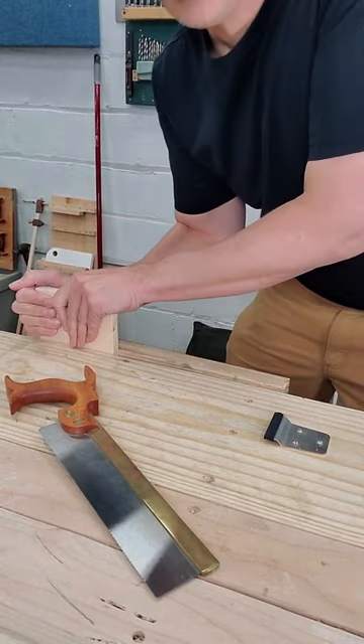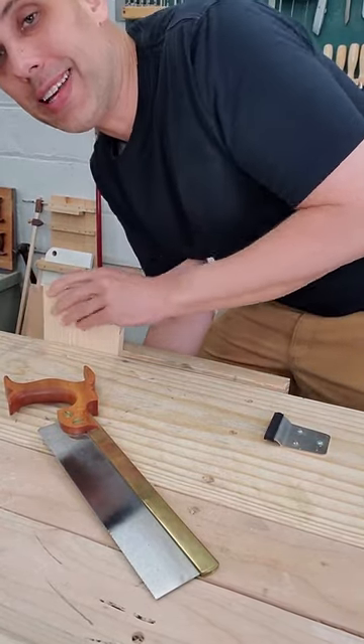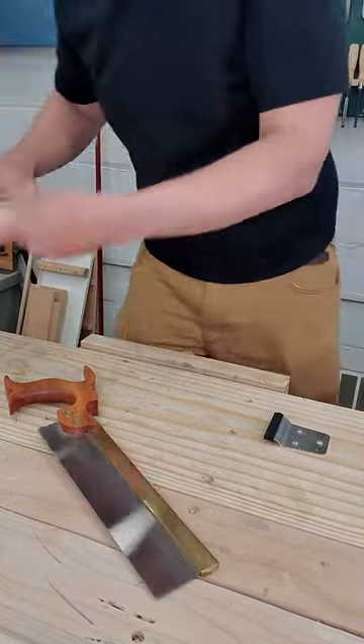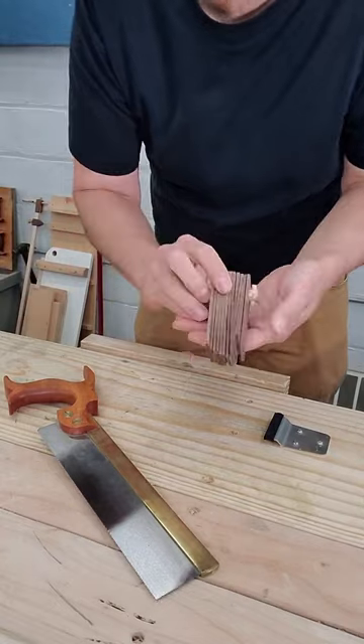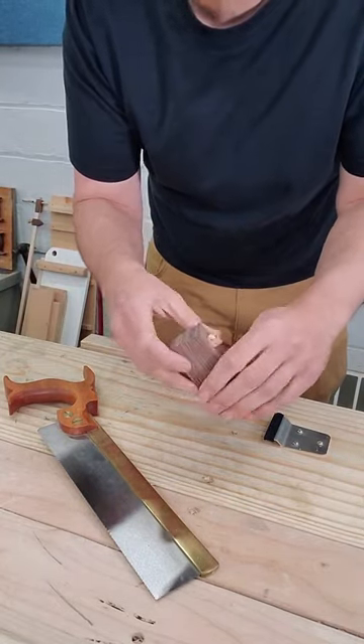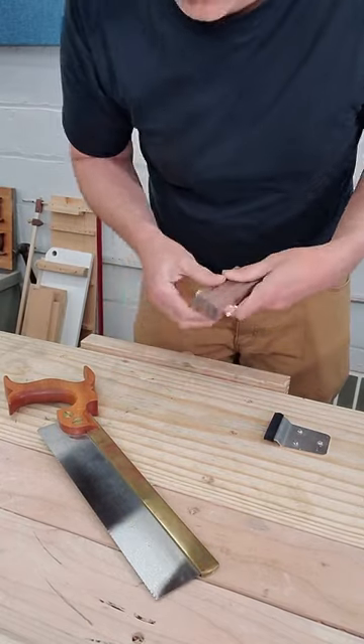It's closing more here and less here, and my board isn't held as solidly as I would like — I can move it around. There's a really simple solution for this. It's called a rack stop. You can make it yourself. It's super obvious: little scraps of wood, or maybe a paint stirrer with a dowel stuck through.